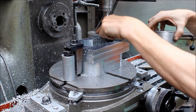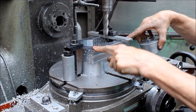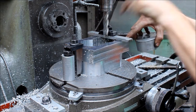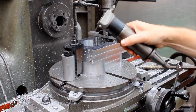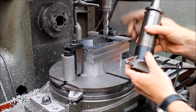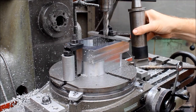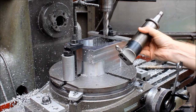What it'll do then, it'll give me a figure-eight shape. And then I can set the borer up to bore them out. So we'll put it against there — it's upside down now. There's your boring bar. That spins around and it's going to cut. That'll go in there, spin round, and you can adjust it to extend it as it goes. And we can bore them to suit the rotors.